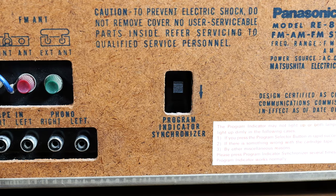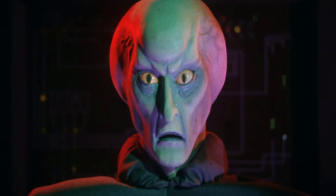Then there's a weird little switch. Occasionally the lights on the program indicator get all screwy — it doesn't cycle through the programs or display which cartridge is playing, and sometimes a light will go dim or two light up at once. The fix is really simple: it's just that switch in the back. You just press it. It is literally a fix button. You have to do it with the machine running, but it actually works. That's alien tech, I'm telling you.